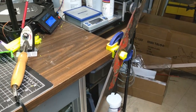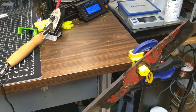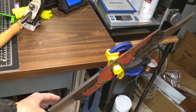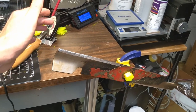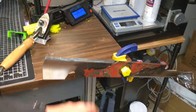This is just like balancing a prop if you're a fixed-wing guy. Heavy side goes down, so you have to remove some material, probably somewhere around there or so. Then move it to all the different orientations and let it go. And once it's balanced, it will stay in that position. Obviously this one isn't balanced — and that's the heavy side.